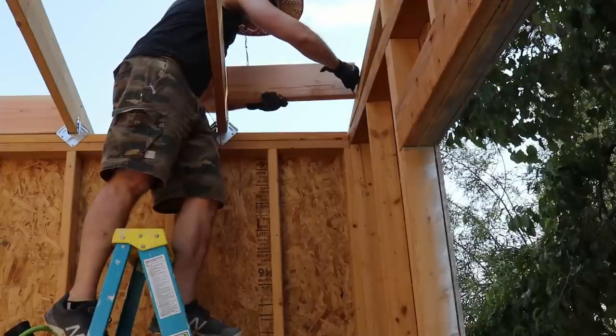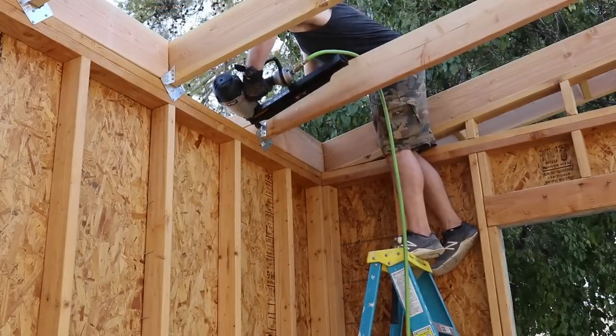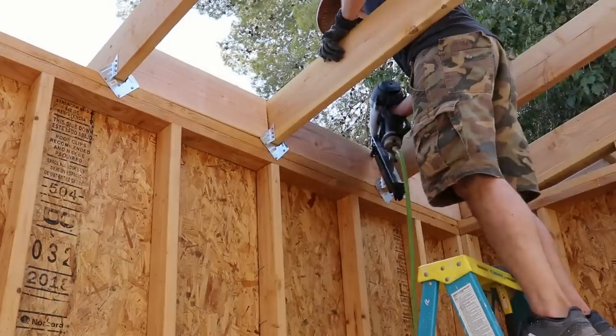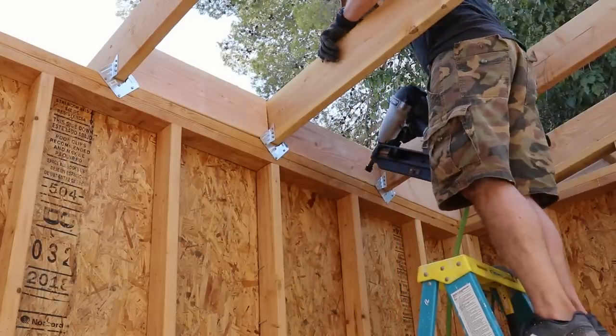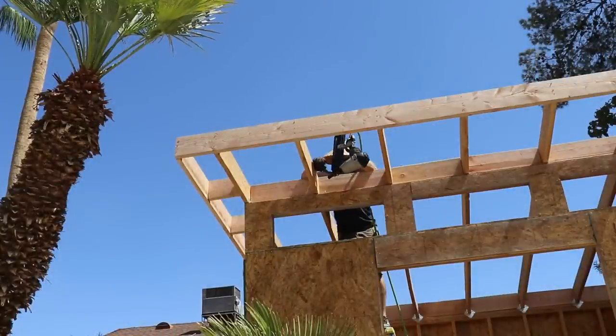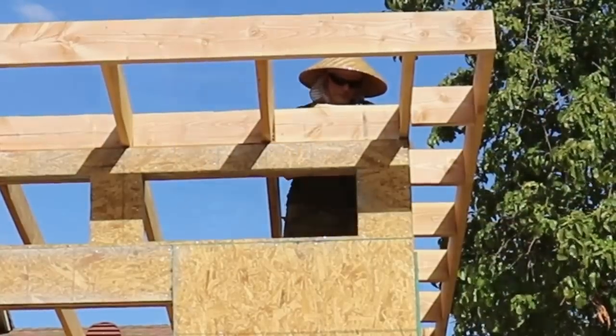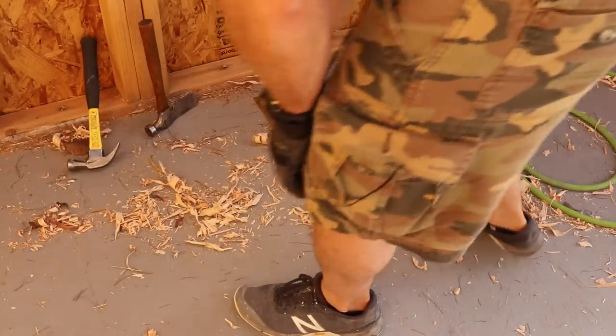All the blocking for the side overhangs was cut to 10.5 inches and installed on the marks we had made earlier. Last thing we need to do is install blocking where the rafters meet the front and back wall. I did every other one to start so I could nail them in from the side, and the ones that sit in between were toenailed in. The smart thing to do would be to put these boards in place, mark where they meet the rafter, and rip cut them to fit. Instead, I used a hatchet and a hand plane to make mine level with the rafters.